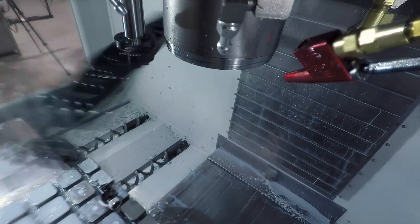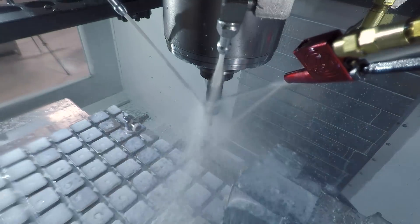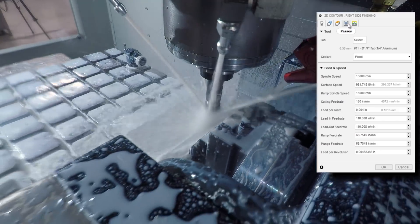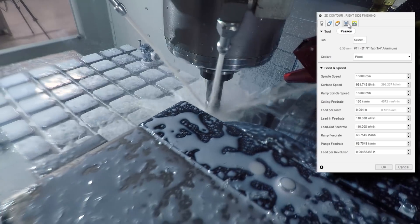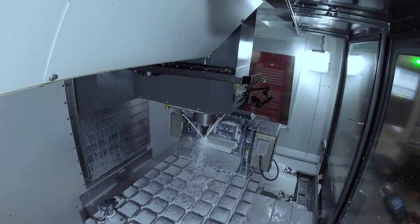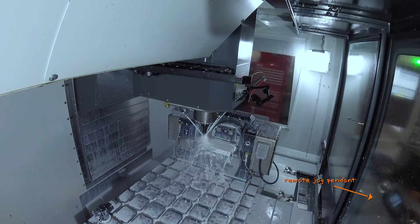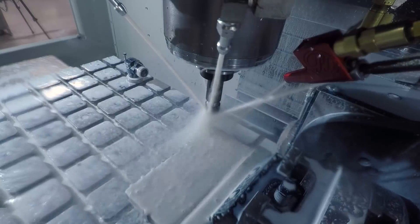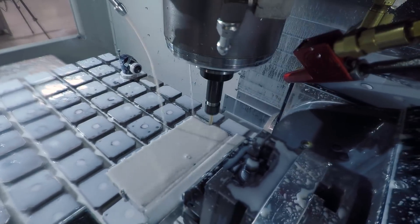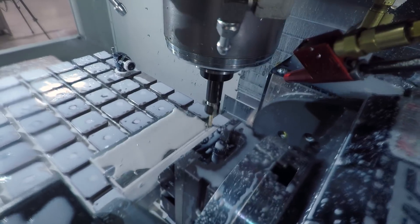On this part I did a lot of the work with a quarter-inch end mill, mostly because I was trying to take it easy thinking that tool pressure would cause more issues than it did. We're going all the RPMs we've got — 15,000, almost a thousand surface feet per minute, four thou per tooth, 180 inches a minute — no problem whatsoever. Starting to get a little closer in terms of collisions. You can see I'm holding the remote jog pendant; we've had this Haas for about two years and I don't think I've ever picked it up. But when you're running five-axis tool paths and you need to look at the machine from a certain orientation, having the ability to hit feed hold and toggle the coolant on and off quickly is really nice.